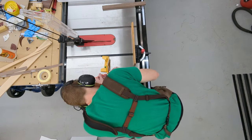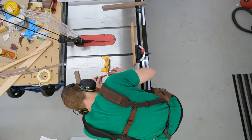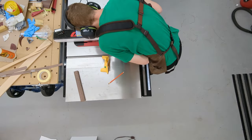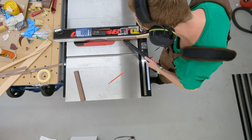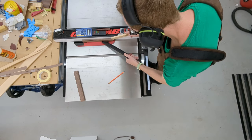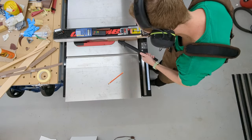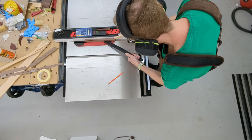After a good bit of sanding and refining the shape, I was happy with the look of the blade. Next, I turned my attention to the tsuka, or handle. Using the table saw, I cut two pieces to the same length. Since I knew how thick I wanted the tsuka to be, I used my microjig fit finder to determine exactly half the thickness of the tsuka. Those two pieces got cut to that thickness by running them vertically through the saw.